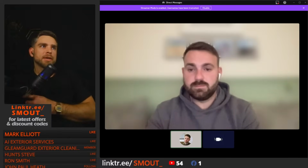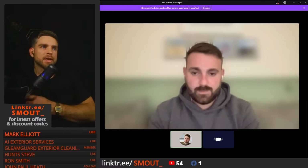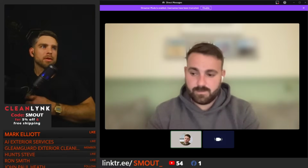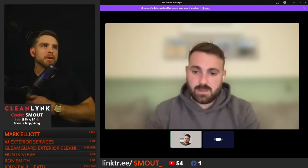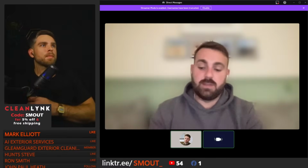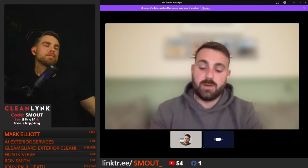I just wanted to catch, Luke's asking about the longevity of Nexus polysweep and stuff. I just wanted to catch this one because Steve said yes, 2 to 3 months with no whacker and 4 to 6 with a whacker plate. I think, Steve, I'm concerned that you're putting out information there that isn't technically backed by evidence. Well, it is and it isn't. The reason he's put them timeframes out there is we've used Nexus throughout the summer and we've not had a great experience with it.